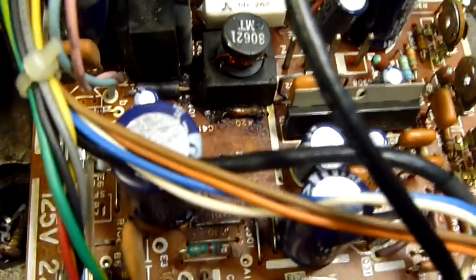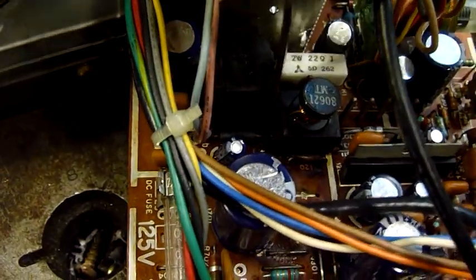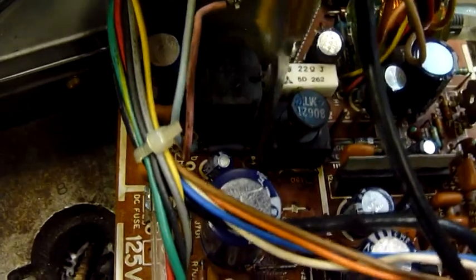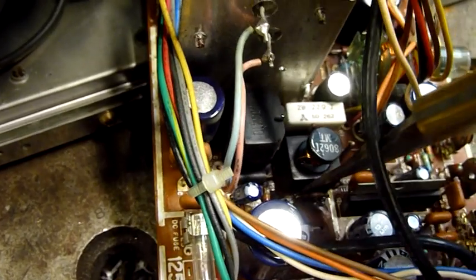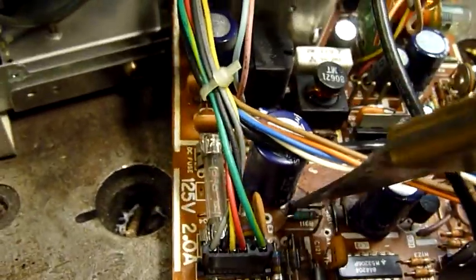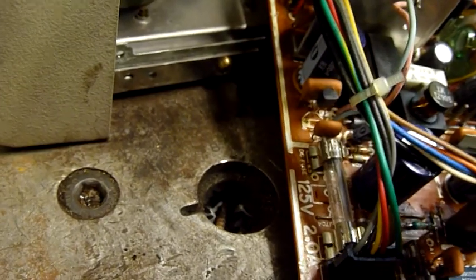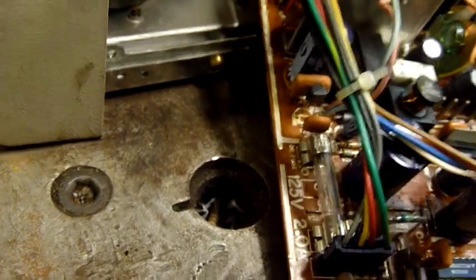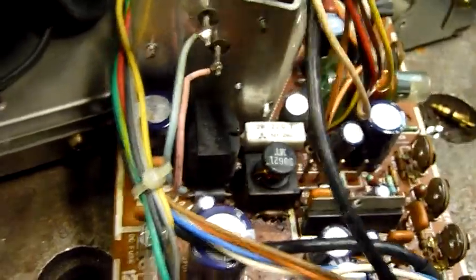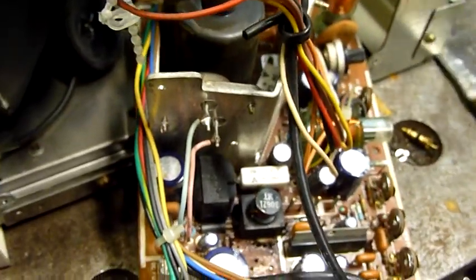There's a good case of gorilla snot problems right around the base of that coil — see it's gone all hard and crispy. That's because it's semi-conductive and has absorbed a lot of moisture. There's also corrosion on the legs of the components. I'm going to remove this coil assembly and these caps and carefully remove the rest of that. I'll try and break it down with acetone — if it doesn't just scrape off, most of the time it goes really hard and crispy and you need to scrape it off with the point of a screwdriver, a knife, or a wire brush.